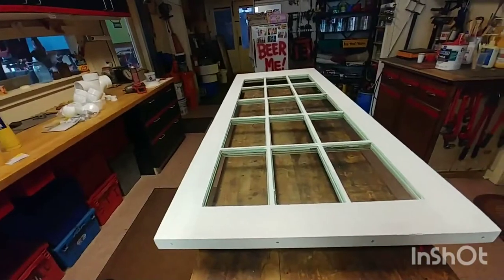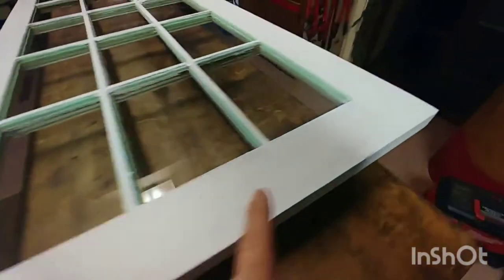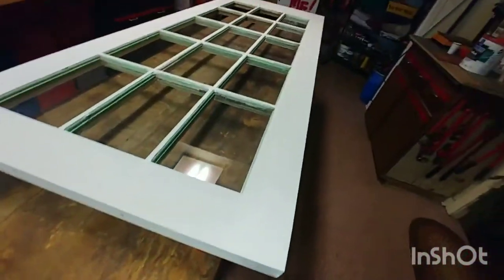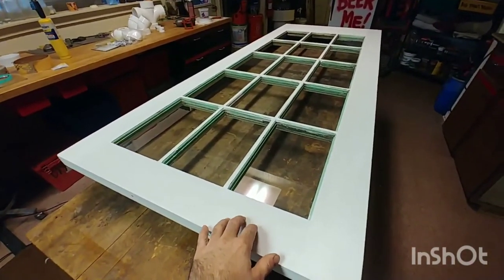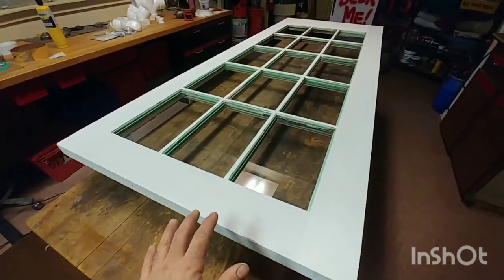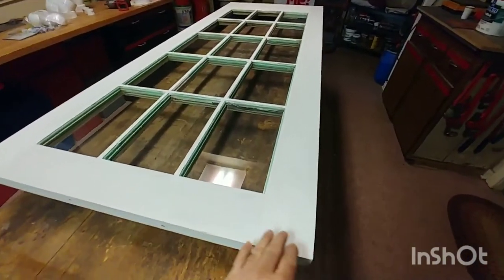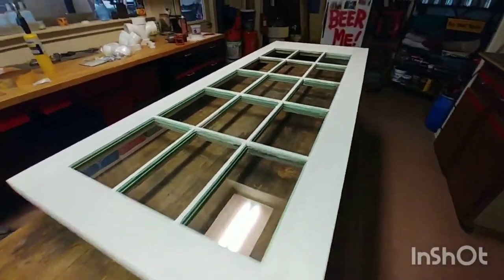And we're going to need two coats on this too. So by the time I'm done sanding the proper grain out, the three-dimensional texture out, and brushing over it twice, the way that the light catches, and again, not a gloss, that's another one that you can do. Step the finish level down to closer to eggshell or satin, and it will be nicer. It'll be easier to hide stuff.